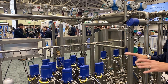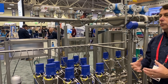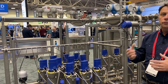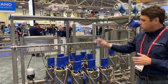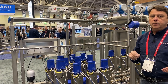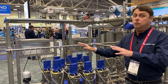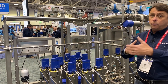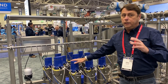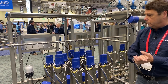The beauty of this system is that when you go to the store to buy hard seltzers, they're often in a multi-pack with two, three, or four different flavors. So customers are having to change over much faster and more often in a day — maybe they were doing one or two changeovers a day, but now they're doing six. If it takes you 30 to 45 minutes to do a changeover, that's downtime. This system will do a changeover in anywhere from three to five minutes — a lot faster, with a lot more production run available.